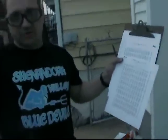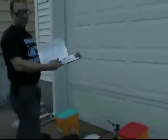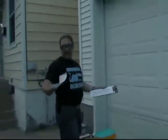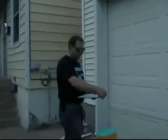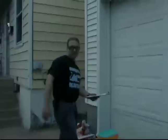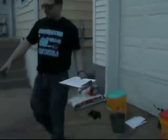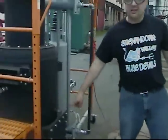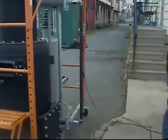So the PLC is going to constantly monitor this and put it on a screen in readable form and in temperature that I could just look at. But I brought these charts out here just to demonstrate how they work. There's going to be at least four of them in the system. And if I end up getting my hands on another RTD resistance card, I'll have a fifth one and maybe even more. There's also going to be a thermocouple card. I'm going to put a thermocouple in the ignition port, so it's also going to monitor that temperature.